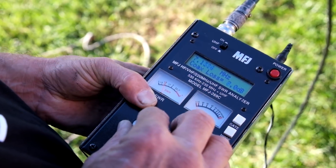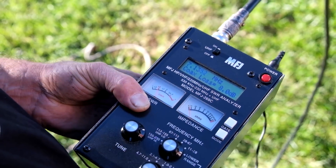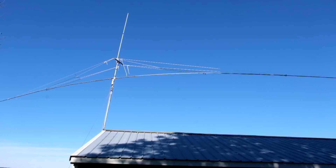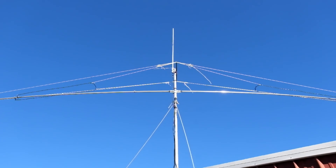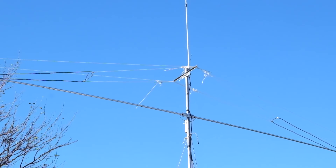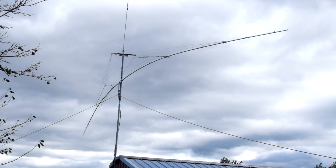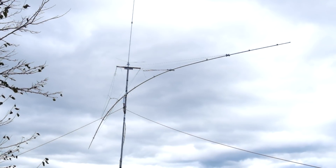So using wire and brackets from your local hardware store and electrical supply house, the MFJ high gain center insulator, MFJ Cushcraft insulators, and MFJ Cushcraft offsets, you can build this antenna for about $250 including a balun. The really nice thing about this antenna is that it gets 40 meters up in the air and in the clear, leaving the tower to support your longer wire antennas. I hope this can give you some ideas. It's certainly a wonderful antenna for us and I hope you can get a lot of good use out of it. We'll be looking for you on 40 meters.